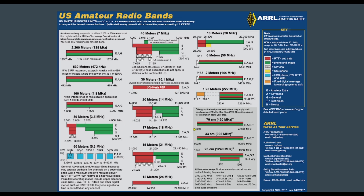Looking at 17 meters at 18 MHz, the band starts at 18.068 and goes up to 18.168, making it 100 kHz wide. It's divided into two segments: red for digital and data where CW is also typically done, and a section for phone and image transmissions. Phone includes things like single sideband or AM modulation — there's probably not much AM on 17 meters. You can also transmit slow scan television on those frequencies. Then at 12 meters, 24 MHz, it starts at 24.890 MHz and goes up to 24.990 — again, 100 kHz wide. It's divided similarly to the 17 meter band.